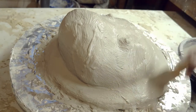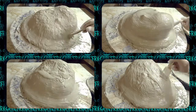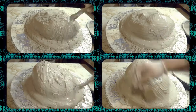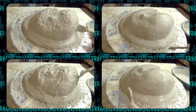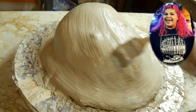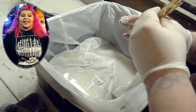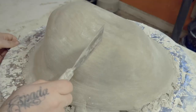Just like before, once the stone is in the magic hardness zone, go ahead and mix up another batch of stone just like the beauty coat. This is the perfect layer to relax to — all the hard work is over. Simply continue adding stone to your mold, building up the thickness and smoothing it out as you go. Don't forget to clean your tools in between layers — it'll save money and headaches. Now just let the mold do its thing. We let it cure overnight, but if you're in a rush, de-mold time is 60 to 80 minutes. Hard as stone!